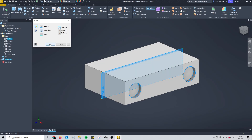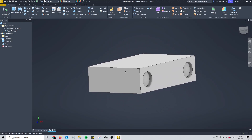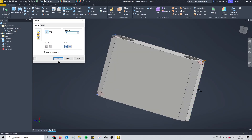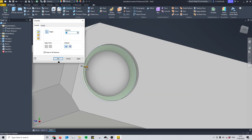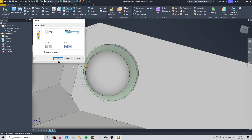If the parts were linked in their current state they would snap together, but the corners of the female part would stop it rotating freely. To fix this, add a 2mm chamfer on the corners surrounding the hinge hole. Then add a 1mm chamfer to help ease the part into place — this makes snapping much easier and means you're less likely to break your print. You can also add very small chamfers inside the holes; 0.5mm has worked well for me. If you follow along or make changes, feel free to leave a comment on what worked for you.